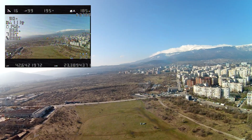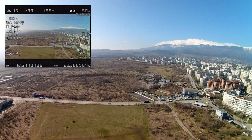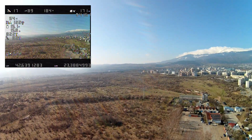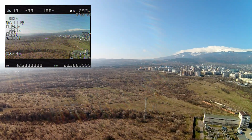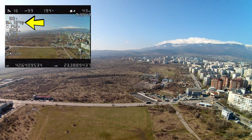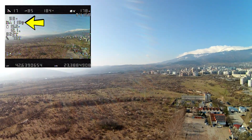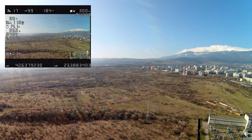Next, I checked top speed, and during maiden the plane was not able to reach 100 km/h at full throttle. After I added the motor standoff, it was able to do around 110 km/h with no wind and 120 km/h with some tailwind, but now it did 128 km/h under its own power with the stock motor, no wind to speak of, which is yet another indication that the tail mods do indeed make a difference.